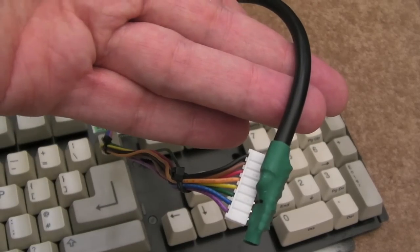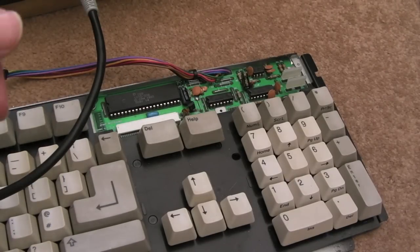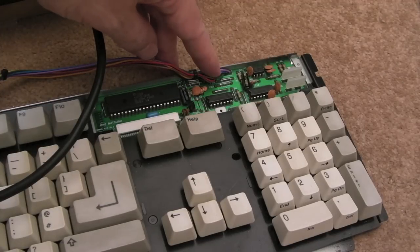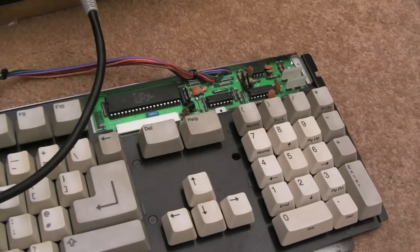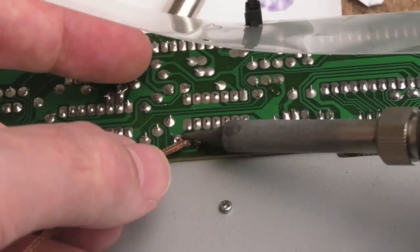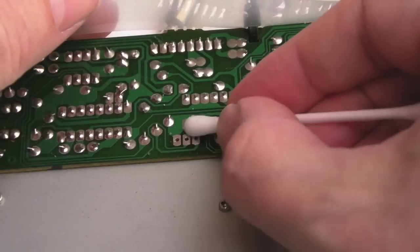The next thing I want to do is get this power LED working. We've got five volts coming into the keyboard. It's not going to have this cable here — I'll still keep this adapter because it's useful for testing on the 2000s, but ultimately I'm going to have a proper DIN connection wired into the new shell. The power LED — we can tap from the five volts, we just need a resistor of the right size. I'll have a look at the schematics to see how the power LED is driven.